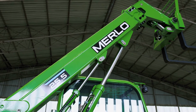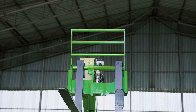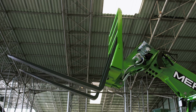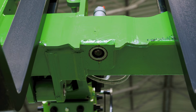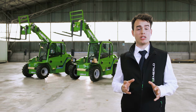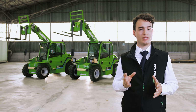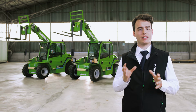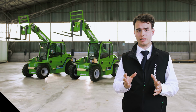The single extension boom is made of high strength steel with welding in the neutral bending axis to better withstand stress. At the head of the boom is an 85 cm ZM2S fork carriage with tack lock for hydraulically locking the attachments as standard. The attachments available further increase the machine versatility and thus extend its areas of application. A pre-arrangement for aerial work platform is available with the possibility of driving from a control panel, so that the E-Worker can be used as a self-propelled platform.